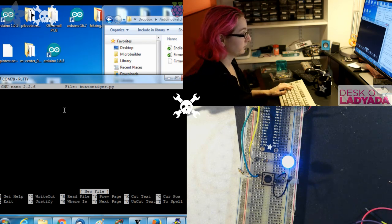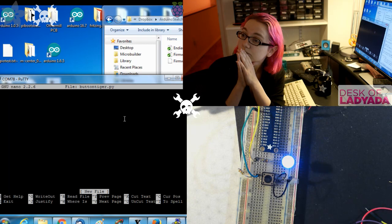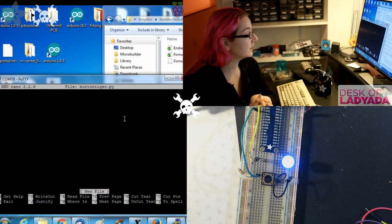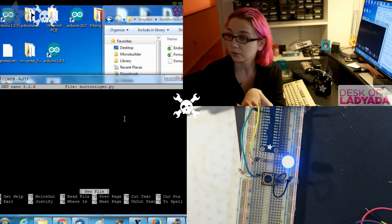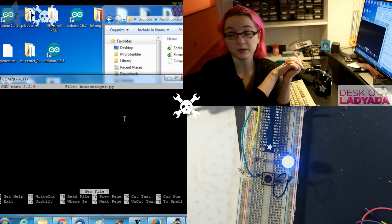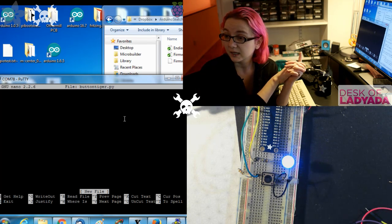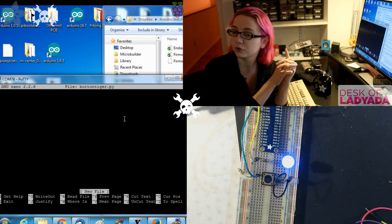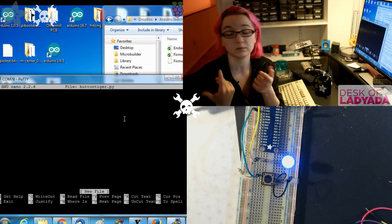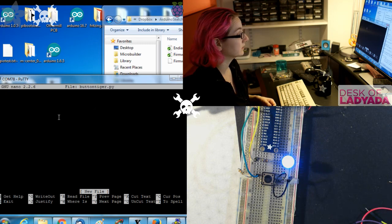Do you want to answer a question while we're doing this? Sure, let's do a question. What about real-time handling of interrupts? I understand that Linux isn't a real-time OS, but how far off is it? You can actually use interrupts pretty easily. I didn't get a demo ready, but maybe at the end I'll quickly look it up and see if I can get interrupts going. You can definitely do interrupts with Python through either RPi.GPIO or a similar library. You basically set up a callback. Again, it's not going to be to the clock cycle, but you don't have to poll. But I'm going to show a polling example because most people are familiar with polling, and it's easy to get started.